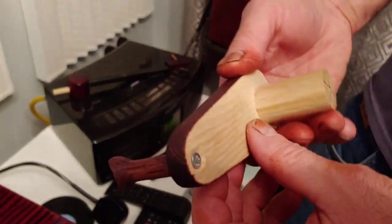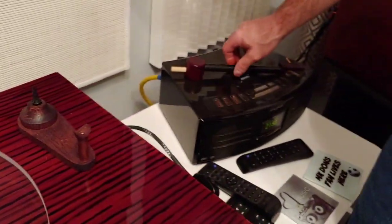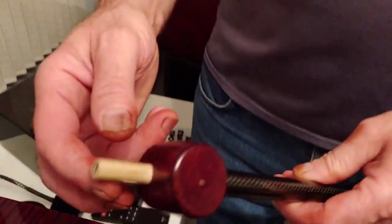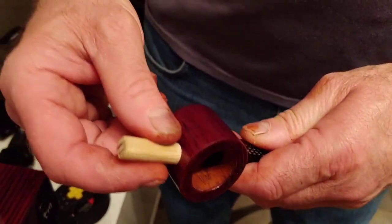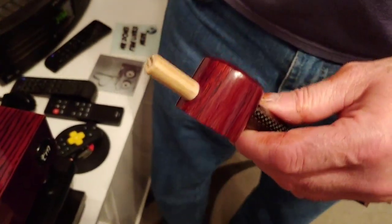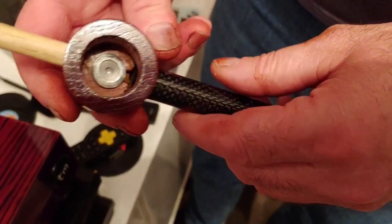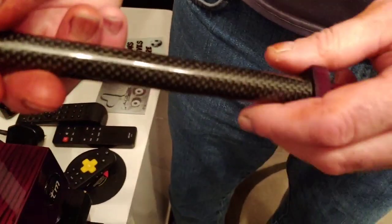This is all made of American white oak - very strong, very sturdy. Now turning our attention to the actual arm itself. I've put a placeholder in there for now, but this is going to be a small metal rod glued in place, and we're making our own counterweight for it. This is where we've got our pivot - it pivots on the spike. Then we've got a carbon fiber tube here which is 16mm thick.